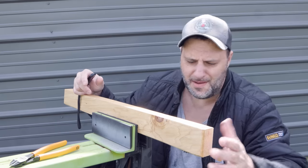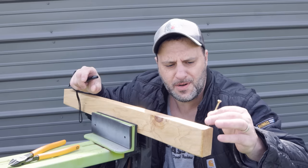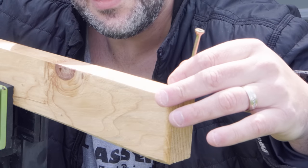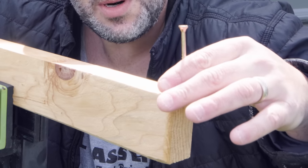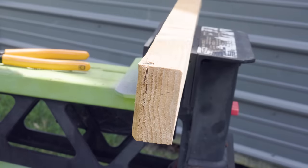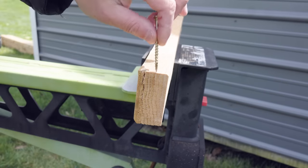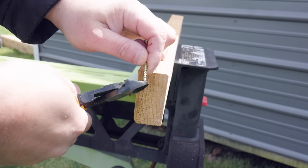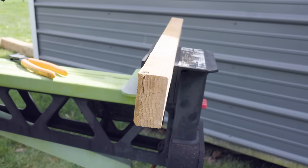So the next one I'm going to have to see to believe. Basically, a lot of people strip out or blow out the side of their wood, and that's not nice. Let's see what happens when I put this screw at the corner of that piece of wood. You can see it split right through there. The premise is that the point at the end is pushing everything out, so if you just clip a little piece of that tip off, it's supposed to stop this from happening.